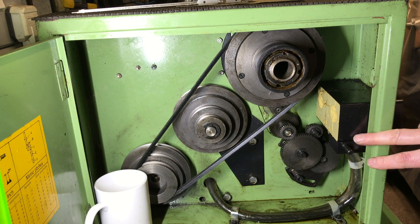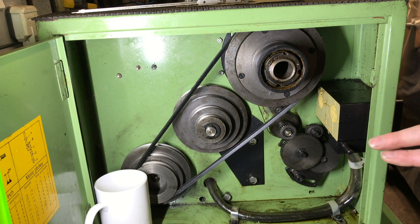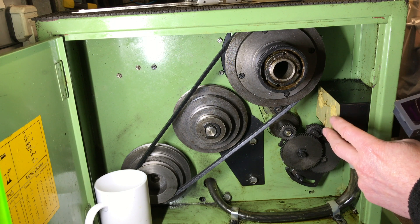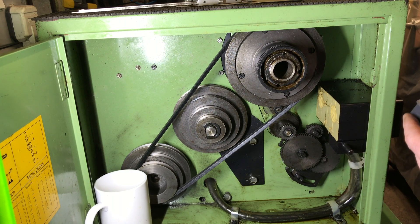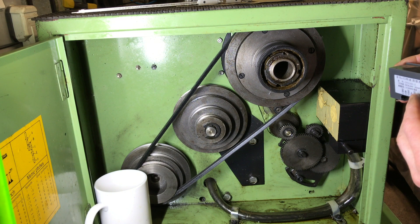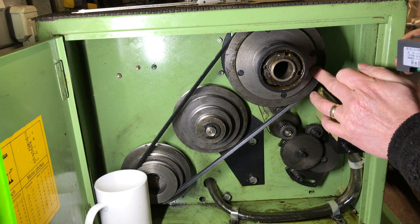There's a big enough box there — that's the on/off switch and reverse switch mechanism for the lathe itself. Because there's power in there, I should be able to pick up a supply for a 12-volt power supply to power the display. It is 8 volts to 24 volts. The lathe is 240 volts AC, so I can't feed straight off that — I need to drop the voltage down. If I cannibalize a plug-top type power supply, I should be able to fully enclose it to keep it dry and oil-free.